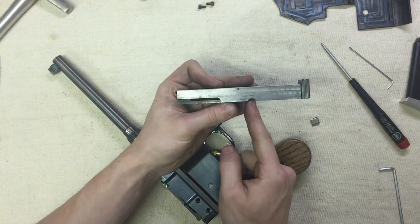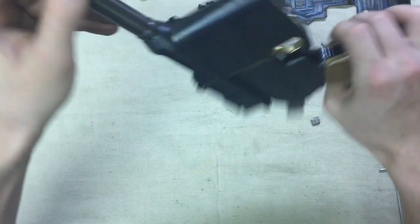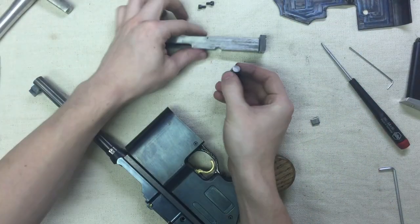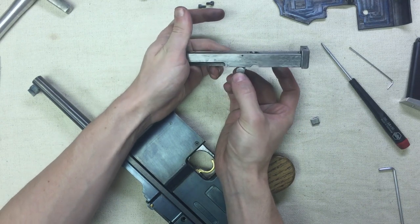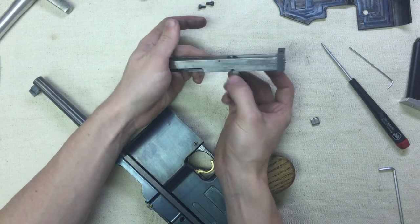We have an ejector, which is not actually spring-loaded per se — it just flops around in there. But when in the gun, the inside of the upper receiver presses down on the top of it and keeps it from lifting up, making it effectively act as a little leaf spring. Here we see the recoil spring and the firing pin inside of the recoil spring, and then there's also a firing pin spring inside of that. This yoke, which stays with the bolt, pushes on the recoil spring, depressing it when you pull the bolt back. Here's that semicircular cut for the roller — fits inside of there. When the bolt comes back, it cams out of that, and that's what pushes on the disconnector.